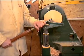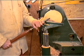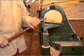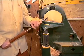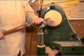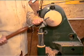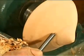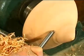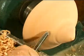The fingernail gouge relies on the bevel same as the traditional grind. One of the advantages of the fingernail grind is pull cuts. There are two distinct types of pull cuts: one simply cuts towards the handle like this, the other cuts towards the rest as well. This is more difficult. The secret is in this swing down on the handle as the tip moves in towards the rest. Keep the cut on the leading side of the gouge.